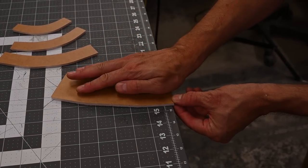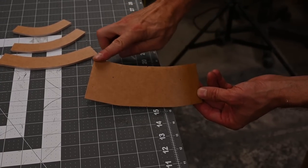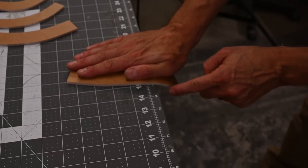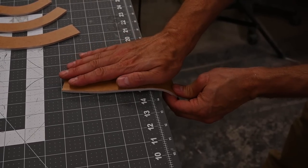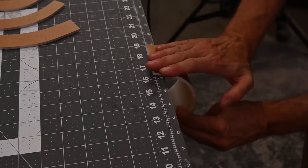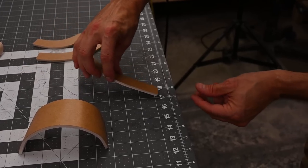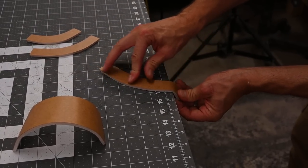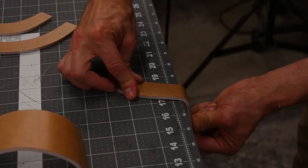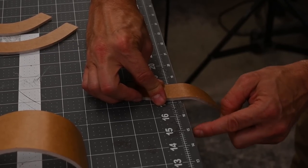We're going to add a little shape to each of them. Just like on the wings, we're going to bring this to the edge of a table and draw it down. You'll notice that the piece itself is slightly curved, so I'm going to make sure there is always a 90-degree angle right here. As I draw the part down, I'm also going to be twisting it just slightly to maintain that 90 degrees. On these smaller parts, I'm drawing it down with my left hand and feeding it with my right hand, watching to make sure this remains 90 degrees.